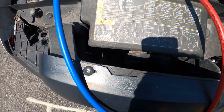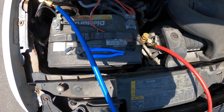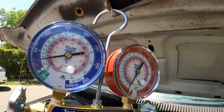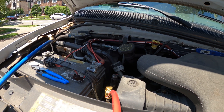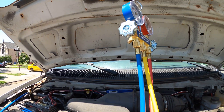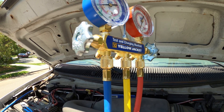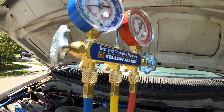For vehicles, we use R134A. In fact, this is technically a refrigerator rather than an air conditioner because R134A is used in refrigeration. Our ambient temperature is around 91 degrees. With this standing pressure, we are completely off on the refrigerant charge. There is a known leak in this vehicle — many vehicles have this issue — so about every year or so we need to top it off. According to our PT chart, we should be at least above 100 pounds of pressure for our standing pressure, as there is a correlation between pressure and temperature. As temperature rises, pressure rises, and as temperature decreases, refrigerant pressures decrease.